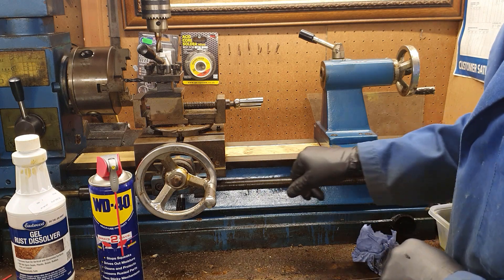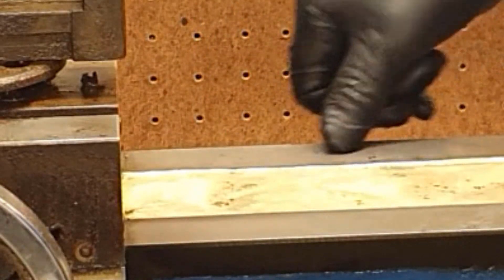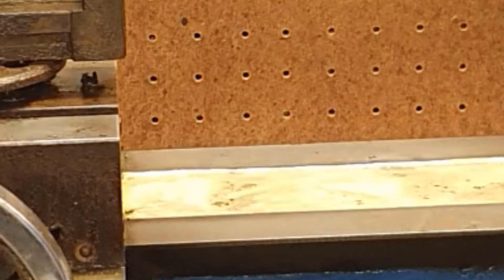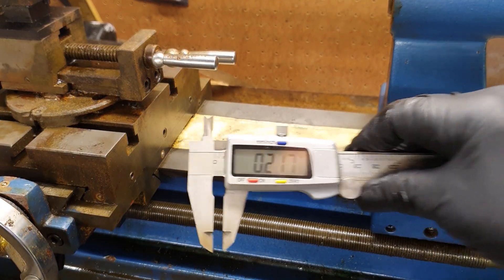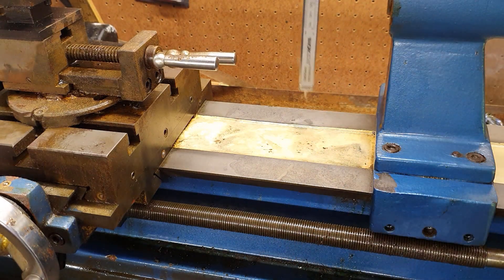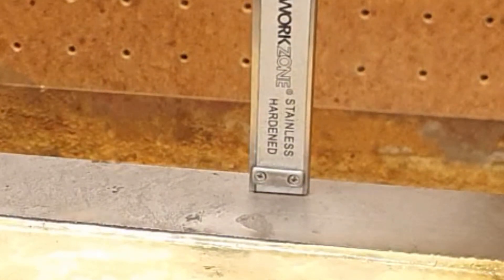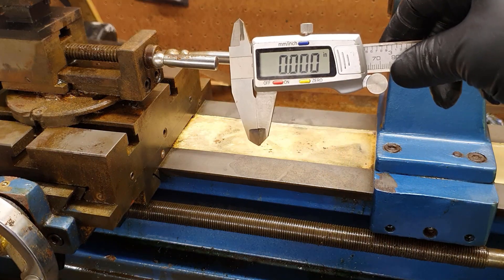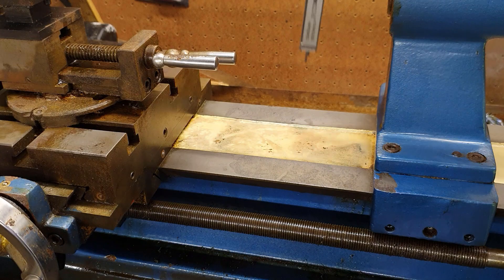Let's bring in and have a closer look at these, and we'll take a measurement on the depth of the rust that remains. There are only a couple of spots — maybe one here and one here — that feel proud. We'll use the vernier gauge again. I'll set it to zero, pick a known decent surface, bring the two parts together, and that is at zero. Double check that to see what the consistency is.